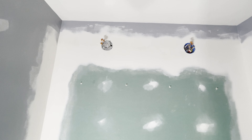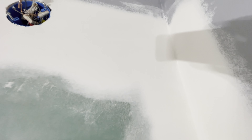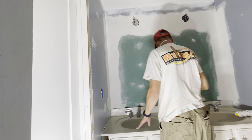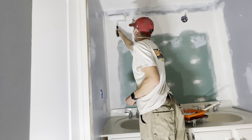After the final sanding, you can see how wide it got at the top — probably about 12 to 16 inches — so it'll have a good fade out. It's a lot smoother now and will have a nice transition, because you see everything once you paint even if it looks covered. One thing I recommend is if you're putting up mirrors, before you start painting, this is a good time to put in wall anchors: just drill the holes, put the anchors in, get all that done in case you need to touch anything up. I'll have later videos showing the primer application. But for this video, this is done — it's ready to go.